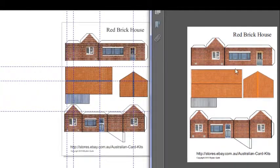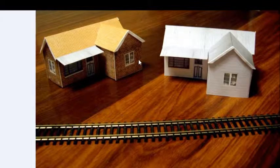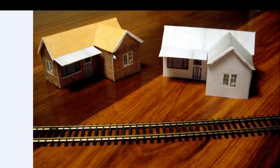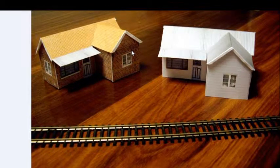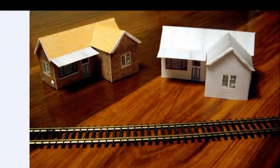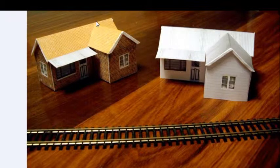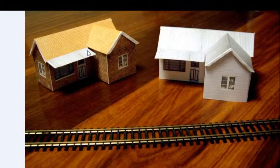So basically anytime you've got a building that has different wings or different parts of the building, you need intersecting roof lines. The key point to remember is you need to start with the information that you know, like the lengths and distances of the existing walls, and then start working out what you don't know, like adding up all the different components to get the roof line length. And then once you've done that, you'll often find that the missing angle that you're looking for can be deduced simply by drawing a straight line between 2 points that you already know.